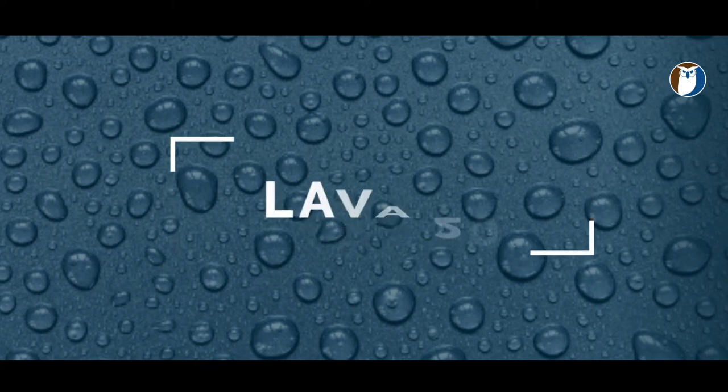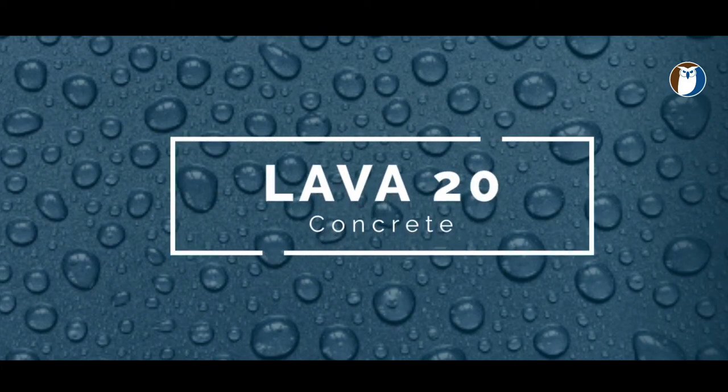We will now show you how to use the Lava 20 waterproofing system on concrete, roofs and balconies, etc. Step one, fill and smooth any joints with the LPU mastic. Step two, tape and reinforce any cracks, transitions or joints between one surface or another. Step 3, prime the entire area. Step 4, waterproofing with Lava 20. Step 5, top coating and anti-slip.